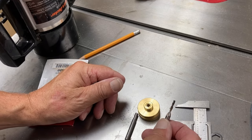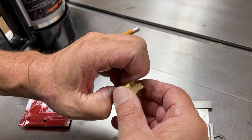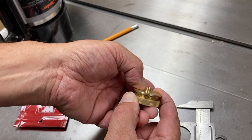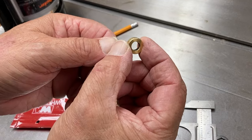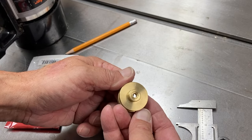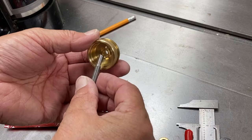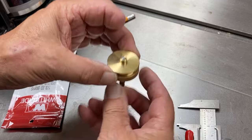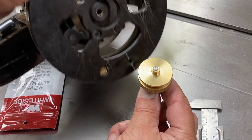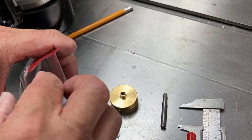Here's the 1/8th-inch spiral-cut router bit. The spiral cut is great because it cleans out the shavings for you. These bushings fit really tightly — there's actually a little groove on the smaller bushing, and on the larger bushing there's an o-ring so that when you slide it on it fits very tightly. It's super accurate — it moves the bit exactly 1/8th of an inch so that you get a super tight inlay when you make those two cuts. It also comes with a centering jig that holds the brass part in your router dead center, so if you happen to rotate your router as you're using it, it will hold that bit an exact dimension from the edge of the bushing in whichever direction you're moving. All these pieces come in just a nice little bag.